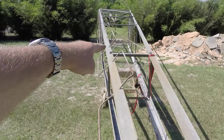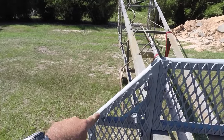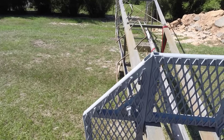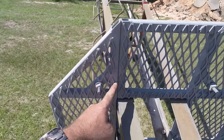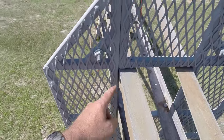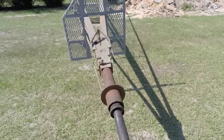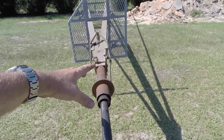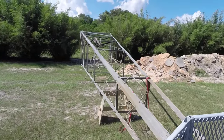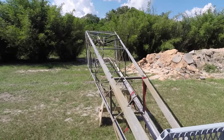Remember we talked about having to cut the corner off — these are the wire steps that lead up to the top of the tower, and when you got here if it came out to a point you'd have a difficult time and the point would catch you in the chest trying to come up onto the platform. Also notice the gate piece right here — this piece will come off. The reason we had to do that is because this is where the windmill gearbox fits on, and we would have to take all of that off if we didn't have a gate down there should we ever need to service it. Quick shot of the tower — it's about 40 feet long, with a few ratchet straps and sling straps to move it around with the tractor.